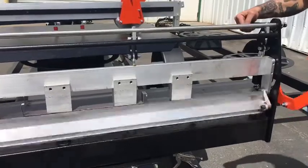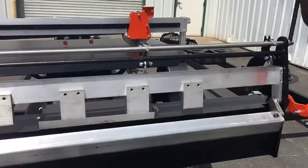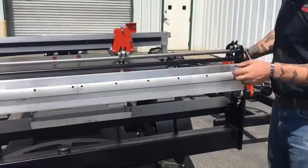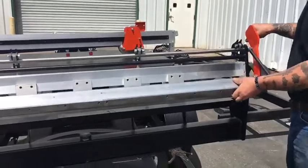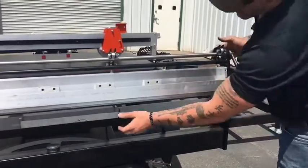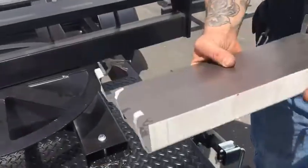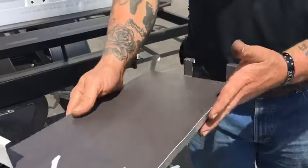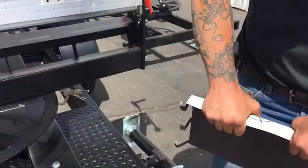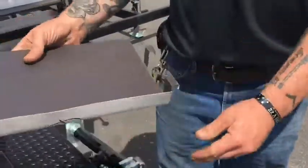There, you'll just hem up, release it, and that'll fall down. You're going to open it up and rotate up at the same time to get your panel out. If you're only doing the one, bring your blade back in until it's back in its regular position. At this point you'll have your up hem. It's not going to give you a perfectly 90 degree angle — it's 45 — so it's already got the crease, just finish it off by hand. If you need to go any tighter than that, you don't need any other tools, and you're ready to go.